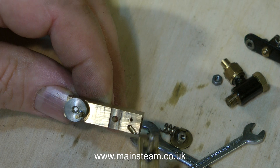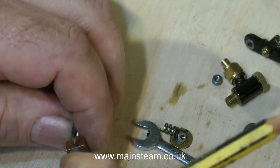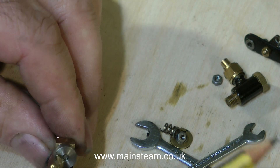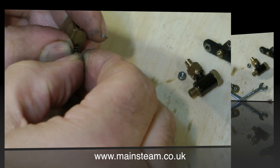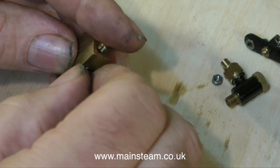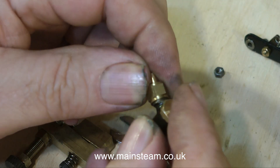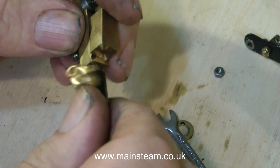I'm going to put the pump back together now before I lose any of the parts. For every revolution of the pump crankshaft, it picks up a tiny drop of oil and then pushes out a tiny drop of oil into the pipe to the cylinder. The spring-loaded clack is just to stop the steam pressure from the cylinder blowing back through the pump. Occasionally these clack valves can fail, usually because the ball is not seating onto the port face inside the clack valve, and that's usually due to some impurity in the oil tank, like a small lump of coal or some ash from the chimney if it's a locomotive. I've found from my experience that in practice these clack valves are very well made and rarely fail.